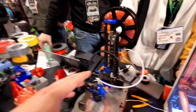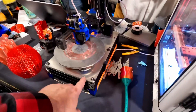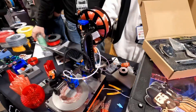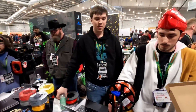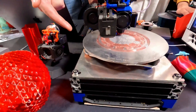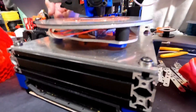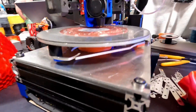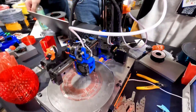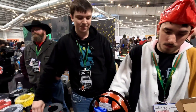The frame — there's really nothing unusual about it. The only thing that's really odd is this base plate here, but everything else looks like normal off-the-shelf stuff you'd find on a Voron. These base plates are laser cut. We laser cut the bed and we laser cut this — we call it 'mall ninja' — which is our bed support. The bed could be just your average 200mm diameter bed, so that plate and mall ninja are basically the only custom cut things.